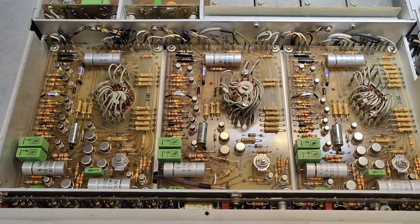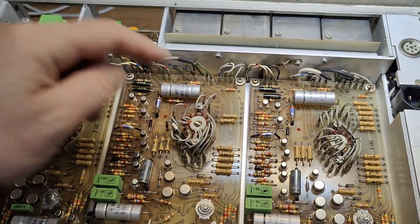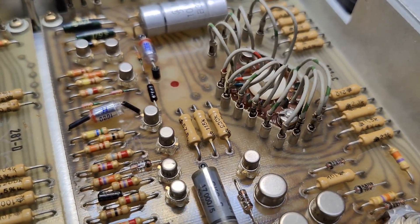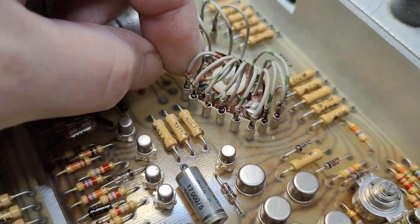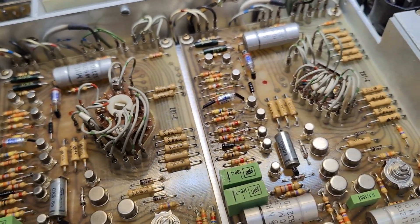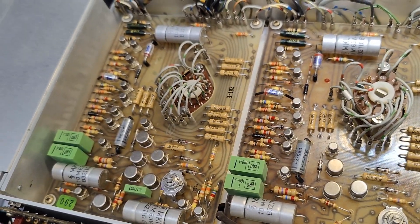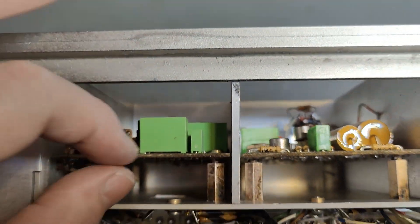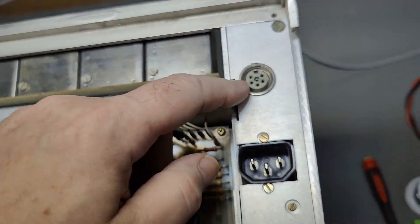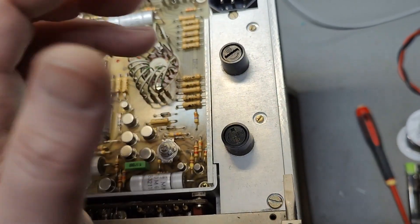Here is the rear side of the unit. The three main calibration setup switches actually go all the way through the unit to the back. See how they made the cable connections to the circuit boards — that is just fantastic. This is actually a single-pin connector so you can pull out and do service on your circuit boards. Those are super top quality trimmers, and again a lot of transistors. This is the rear panel — the battery power entry, mains entry, and the mains or low voltage fuses.